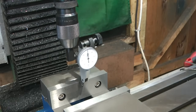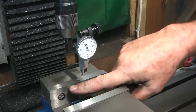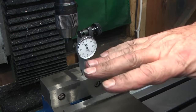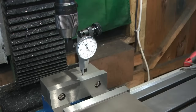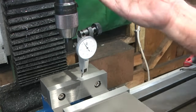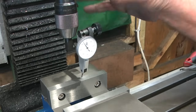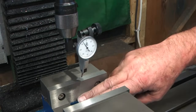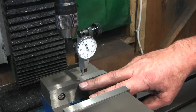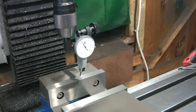Yeah. So as it stands on the mill setup as I've got it, I'm about 10 microns off on the tram in the vertical. That said, I haven't trammed my head for quite some while, but it's got no nod adjustment, and when I originally set it up and bolted it all down, I got it pretty much within about 10 micron. So it could be the run out in my head or in the travel of my quill, could be that 10 micron, or it could be the drawbar. But it's certainly much better than I thought it was going to be.